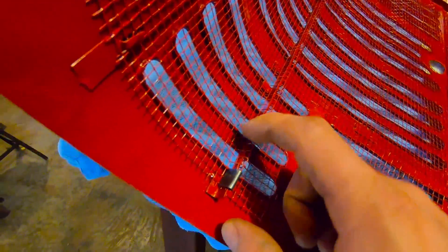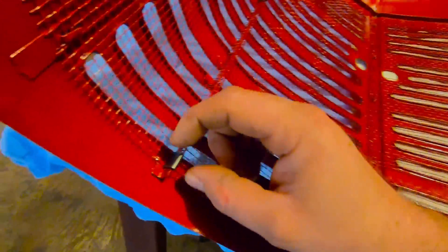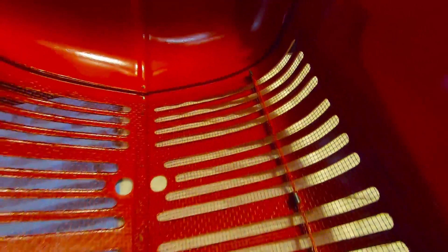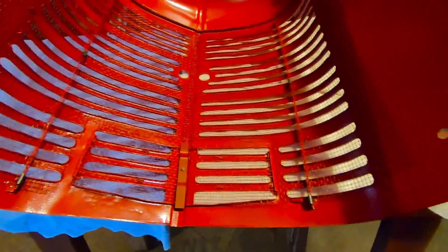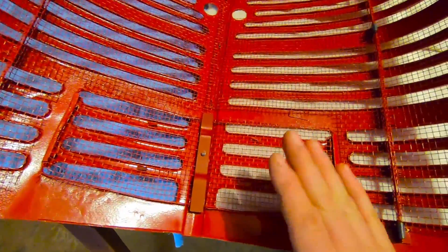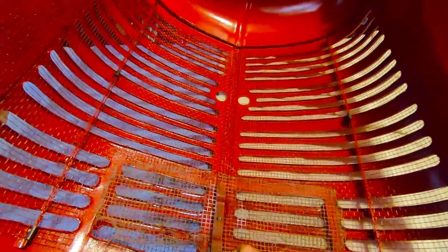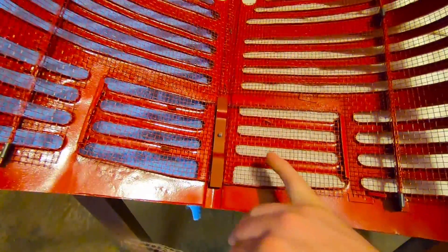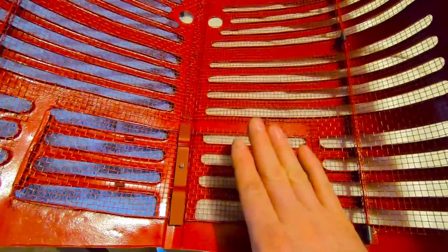You can see why I had to bend them to go around. I called this piece a slat earlier - that's probably not the right word for it. It's just a metal strip that spot welds to the back of the grill, one on each side. These little friction clips that you just crimp on are also available from Steiner Tractor - I got a set of six, so three on each side. That helps to locate the screens on those strips, and then they're also retained by these little fold-down tabs that are pushed out of the back. That stuff fits really well, very happy with it. The rectangular piece right here that goes behind this removable lower portion - that thing would have to be taken off for some mounted implements. We don't have any reason to ever take this off, so I actually made this screen a little bit bigger than factory so that it went beyond the opening in the main part of the grill. That makes it look a little cleaner. Since we're never going to have that removable piece out, I wanted it to look like it fit a little bit better, just give a little cleaner appearance.